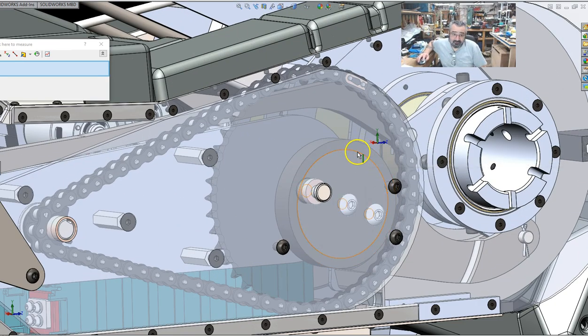again, these two pieces will have to be pretty precise. You're not going to be able to have a rough surface on one and the other. There's going to be grease in there. But the more precise you can get it, where it slips in nice and then just spins right around, the longer the system's going to last. If you have it machined and you have a bunch of chatter marks in there, and you haven't come up with some way of honing that out or boring that out, or putting the eccentric lobe on a lathe and turning it to get a nice finish, rough finishes are going to make for very rough operation and it's not going to last long.